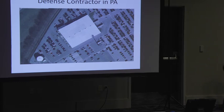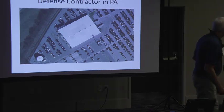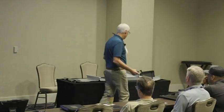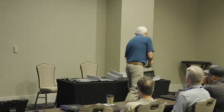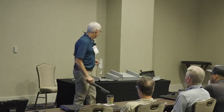So I was on this call with these guys. I said, why don't you get us this information? There's about 10 measurements that a roof hugger needs in order to do these calculations, and then they can run the numbers to see what the roof hugger will do. Plus they wanted us to bring an insulation code. So I had to figure it with this roof hugger, right? This is a roof hugger for an R panel as well. They both go on R panel. This is 4.5 inches tall. This is 1.875 inches tall.